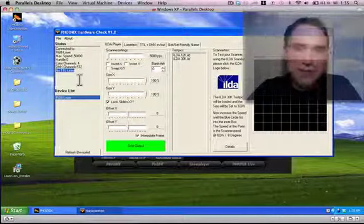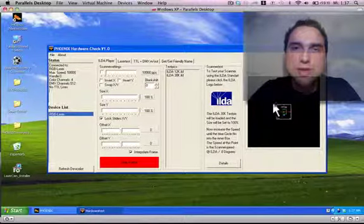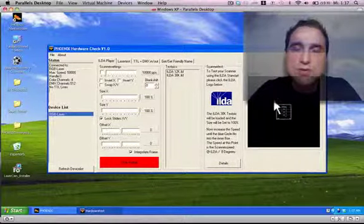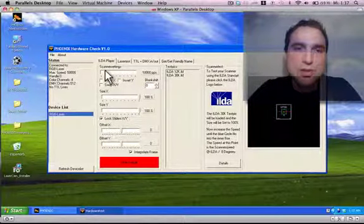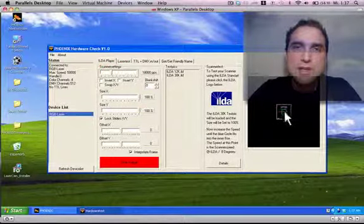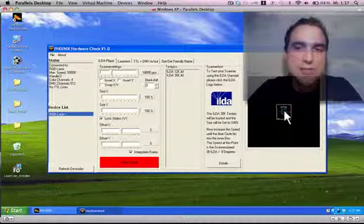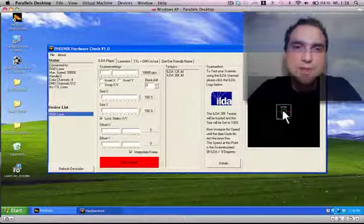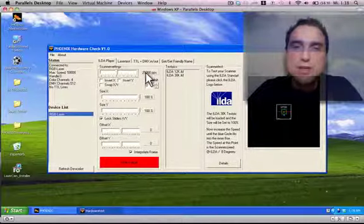Okay, how you go on with the program itself? Press now on the blue ILDA button here to get the typical ILDA test pattern on your laser. You will see now on the wall the white square, the green square and the blue circle in the middle. Turn the scanner settings slider now slowly up until the blue circle is exactly in the middle of the green square. It should touch the lines, the green lines, but shouldn't be smaller than the square itself. So in this moment, when it perfectly matches in the square, let's say it's about 25K, in this moment you know exactly the maximum scanner speed of your laser.